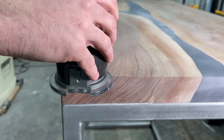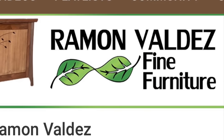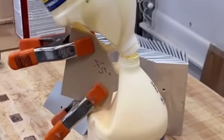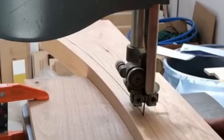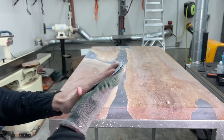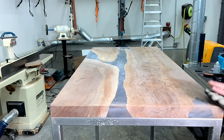If you love a good woodworking hack — anything that makes your life easier without costing a lot of money — like this DIY sanding glove I found about a year ago, you're going to love Ramon Valdez. I've been using my page to promote smaller YouTube channels to get them off the ground, and I want more videos from Ramon because he has some awesome tricks. Head over to his page — link in the description. The sanding glove is basically just a gardening glove, some spray adhesive, and some Velcro. I recommend using the Festool interface pad because that will make your Velcro last a lot longer.